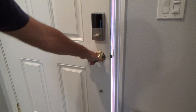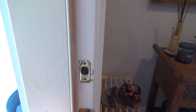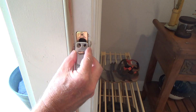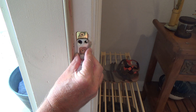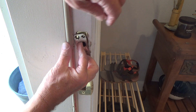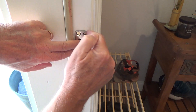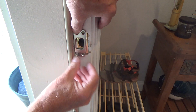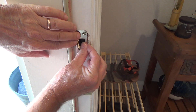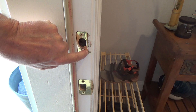Before I put this in, I think when I adjust this strike down here, it's going to hit the edge. Looking at this, this is just a hair bigger than that. Holding it on there, it's the same width from that edge to that edge. When I hold this before I mortise this out, if I just use this edge right there and mortise out over to the left rather than all the way around it to center it, I'm sliding it over to the door just a little bit more. That's going to give me just a hair if I use that edge of that line.